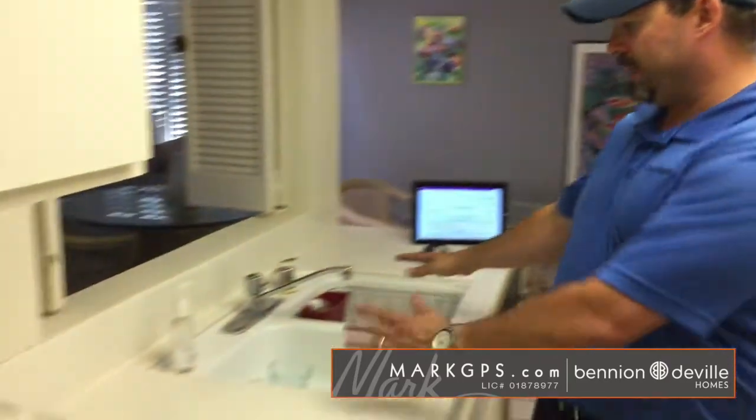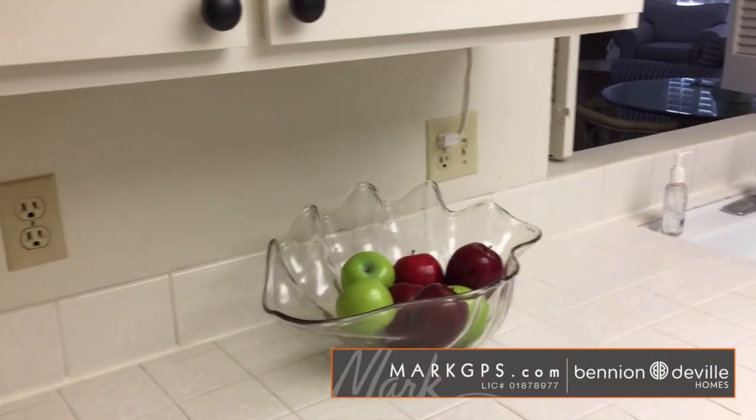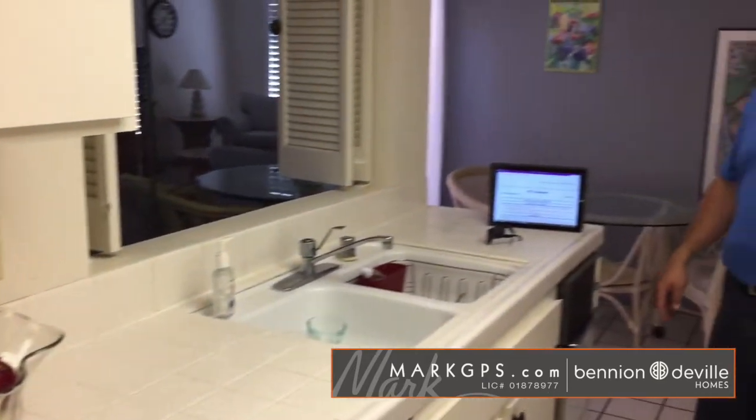Good. Yep. Here in the kitchen, two outlets on the wall adjacent to the sink are not GFCI protected again. Okay, so a lot of the GFCI pieces are probably original to the house. Yeah, 1979 is when the place was built. All the exterior, the garage, bathroom should have been GFCI. They added the kitchen later, but when you're transacting, you need to bring those things up. Okay.